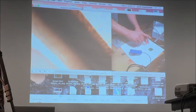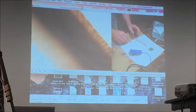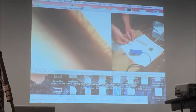Just to let you guys know, you see a 220, like on all the resistors? It's a 2 and a 2 and the number of zeros afterward. Yeah, these are 22 ohms. So 22 ohms is what people don't know. Those 220 and 220 are 22 ohms. You see that a lot on surface-mount parts.